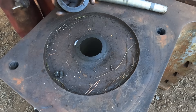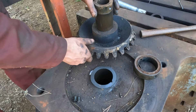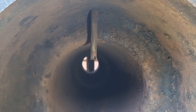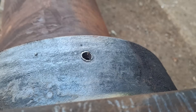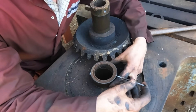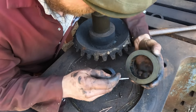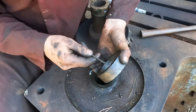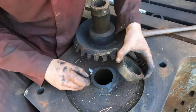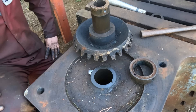There we go. Now I just need to go fishing. This gear hasn't seen the light of day in maybe 150 years, but there's some interesting stuff going on here in terms of oiling. Underneath the column there's a little drip pipe, and that drip pipe is connected to an oil hole. Oil comes through and lands in this trough — the oil pipe is stationary and the bearing moves around it. Oil fills this trough and then goes down through a hole, lubricating the surface, and there is an oil groove there too.